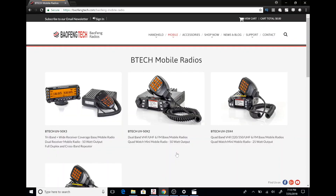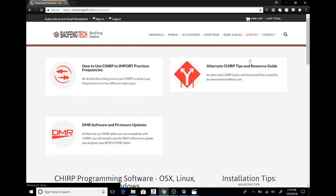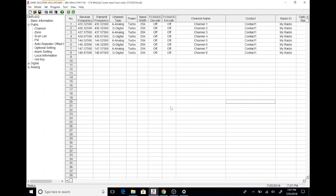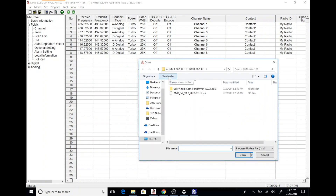In order to upgrade your firmware, you're going to need the programming software and the latest copy of the firmware. You can get this off of the Baofeng Tech website — I'll include a link below. When you go to the website, go to support and then the software section and you'll see what you can download. You want to download the latest version. Once you download the zip file, extract it to a location on your hard drive and then run the install program so you have the software installed on your machine. The extracted folder will contain the upgrade for your firmware. Run the application and from the menu bar, pick Tool and then Firmware Update.